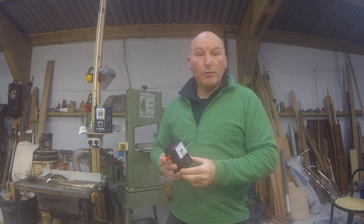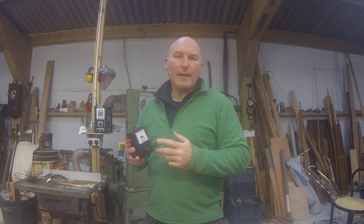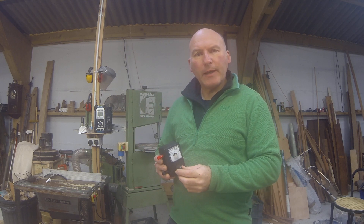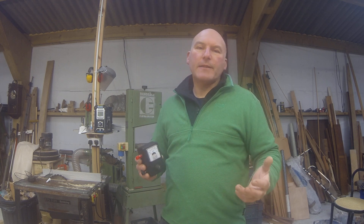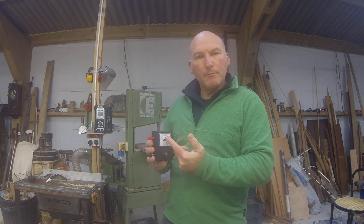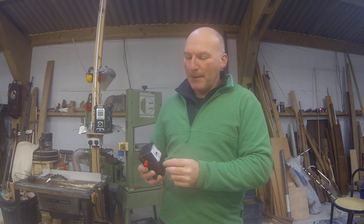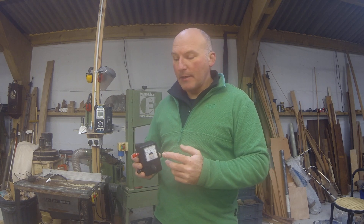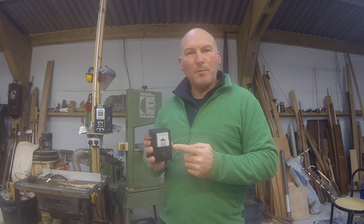One piece of kit if you're new to ham radio that you can build yourself is a field strength meter. Why would you want one? They're ideal for checking your radiated power - maybe not necessarily measuring it, but it can give you an indication of your antenna, your radials, counterpoises, your general setup, and how well your antenna can radiate. It can also check for common mode currents on your coax.